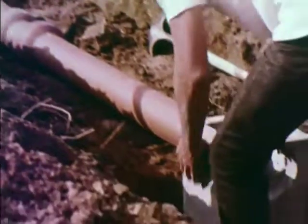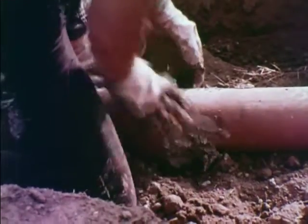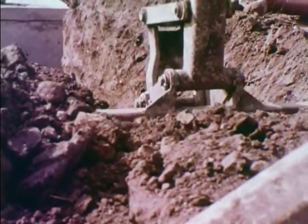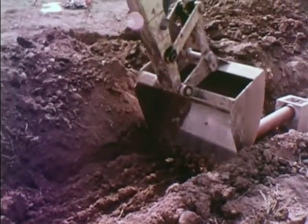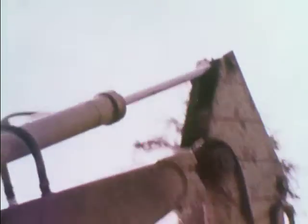The first drop box is set and all joints are cemented. The soil between each drop box cannot be any deeper than the top of the gravel in the preceding line. This undisturbed soil acts as a dam to prevent the sewage from running down the slope. This is probably the most important point in installing a septic system on a hill.